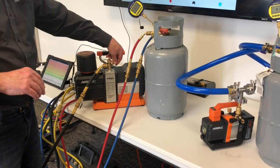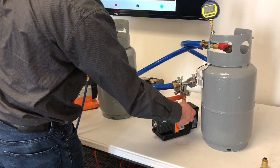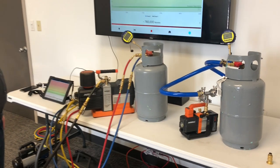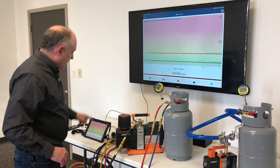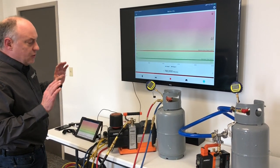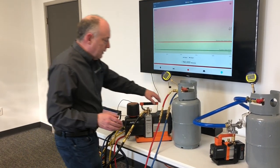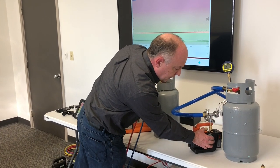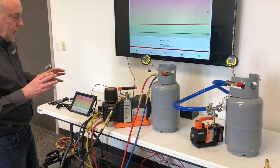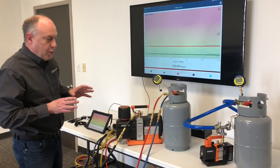Right here I've got the caps off both of these — I'm going to put them on now. So they're both open to atmosphere; you can see that both tanks are completely open, broken to vacuum. Both gauges are at high pressure. I'm going to restart the recording and start these pumps up. These are DC pumps, so they start a little differently than a regular AC pump. They're a soft start, so when you hear them spin up they're going to sound a little different than you're used to. Both pumps are starting to run now — you can hear them both coming up to speed, and it'll be a second before they actually pull down.